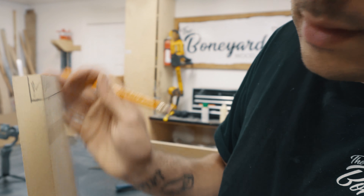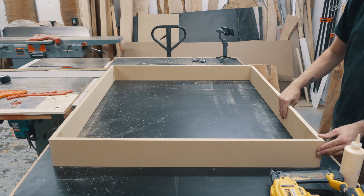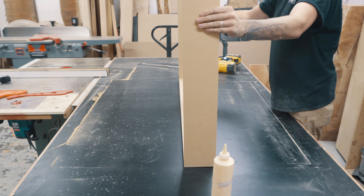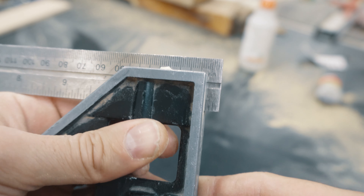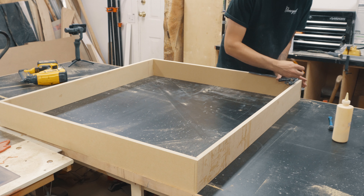I continued those steps on both pieces, then removed any excess and marks with a chisel. I marked out my uprights, bearing in mind I wanted to take a quarter of an inch off for wiggle room and three-quarters of an inch off to allow for the rebate, then cut them to length. I gave all the edges a small round-over using my quarter inch router, and then sanded all faces to 150 grit and all ends to 400 grit.